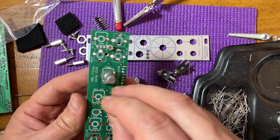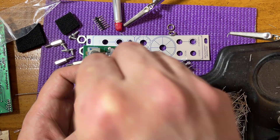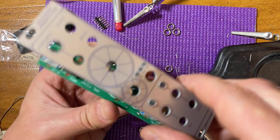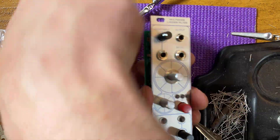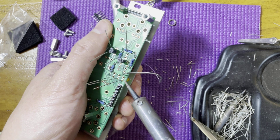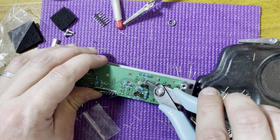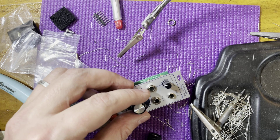Now we can go back to the board and plug in — but not solder yet — the pots and tall trimmers. Now the switch, making sure the protruding line on the switch matches the drawing on the silkscreen. Now insert the sockets and the LEDs, but don't solder them yet. First slip on the panel and finger-tighten some of the nuts to hold it steady and flush. Make sure the LEDs are flush to the light pipes, then go ahead and solder everything. For the button I used the snake charmer again, so I could push the button up with my finger while soldering.